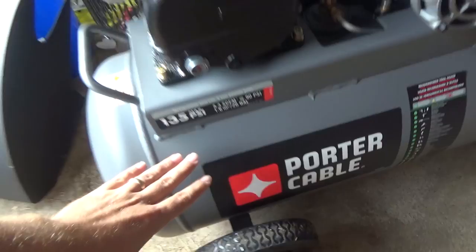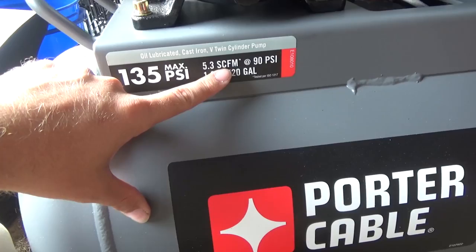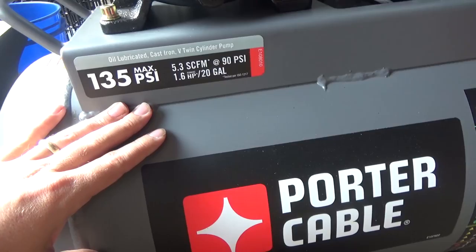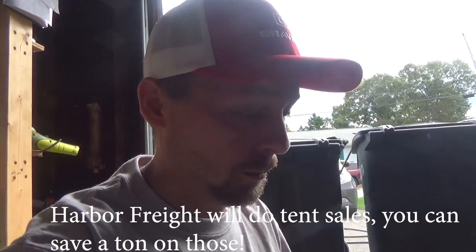If you're doing it the wrong way year after year, you're going to wear that stuff down quicker. Manufacturers actually say even this compressor isn't quite enough volume — they want like 11 or 15 CFM. If you're doing it professionally you want the massive one, but homeowners can take their time and save some money. This one cost me about $350, but around here professionals charge $100 a pop to blow it out, so after three or four years I paid it back and now I have an air compressor.